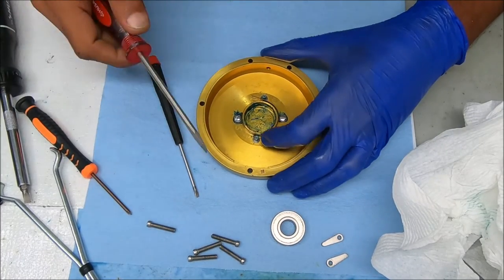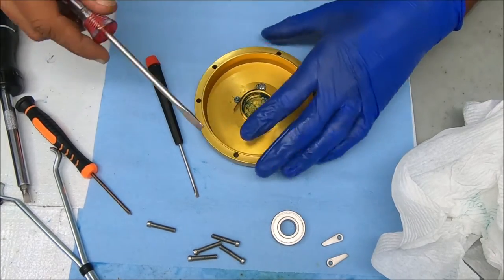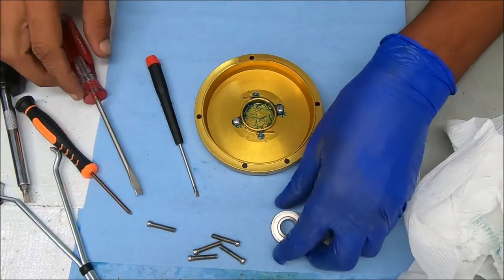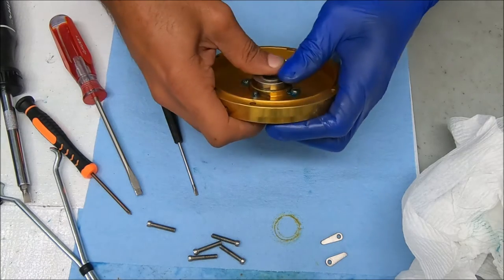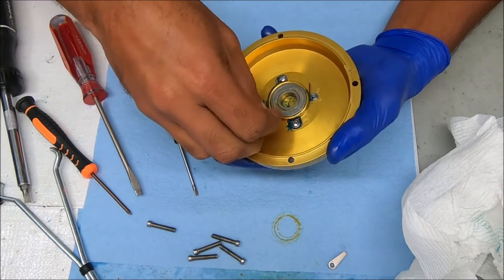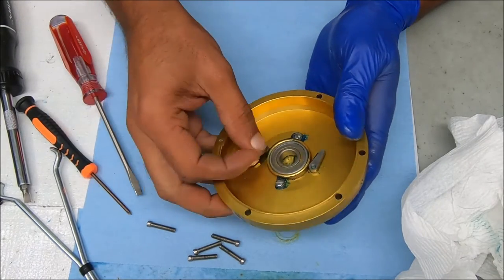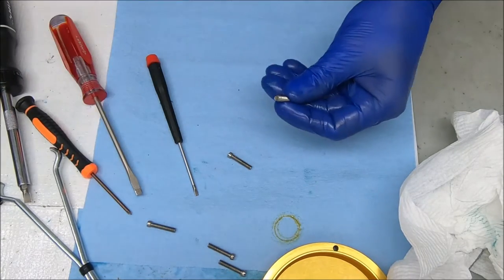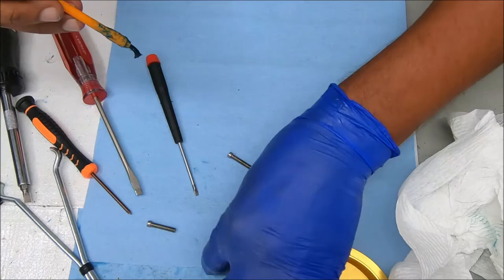When you tighten these things down, make sure you have that clip under that bottom portion of the post there, so it's not riding up on top of it. And I'm gonna stick the bearing back inside, and we're just gonna place the dogs on. While I'm here, I think I'm going to just grease these screws up, then place them inside the left side plate.